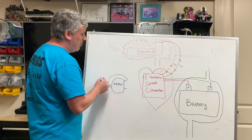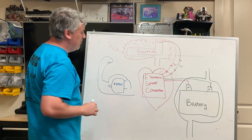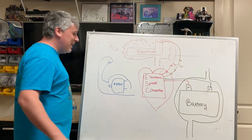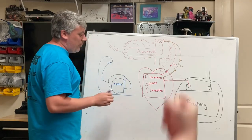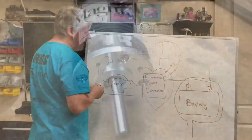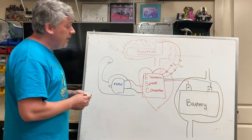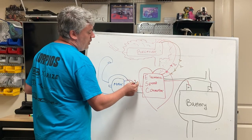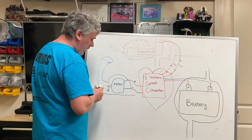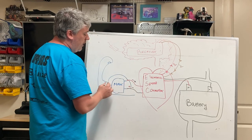This is the robot's muscle. It's hooked up with either two or three wires — the positive wire and the negative wire. Typically they will not use red and black; like a Finger Tech speed controller will use blue and purple. That's because these wires can change polarity. Positive one way, negative one way will turn the motor clockwise. But if you flip it — negative that direction, positive on the other one — it'll turn counterclockwise.